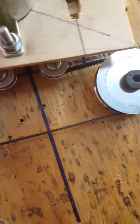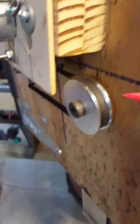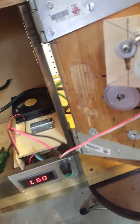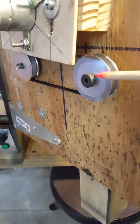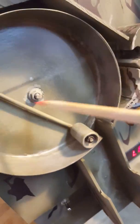Other than that, the rest of it is pretty simple. Behind here on this side and this side, there are bearings for the shaft to go through. All this stuff is metric, so we have an 8mm shoulder bolt going through and it has 6mm threads on this end. I drilled a 6mm hole in the center and she lines up beautifully.